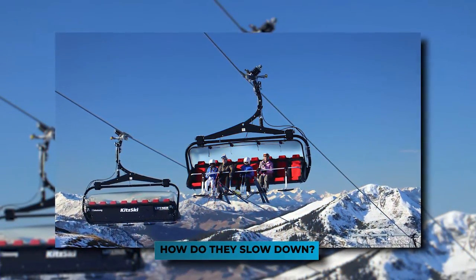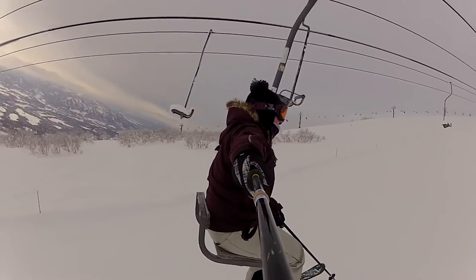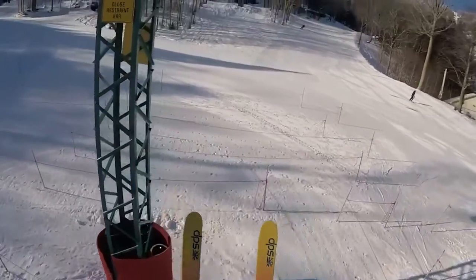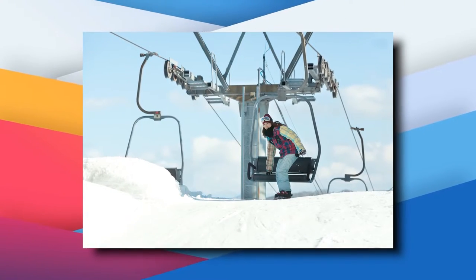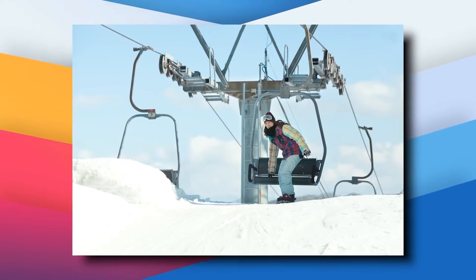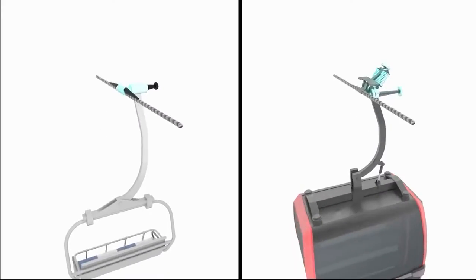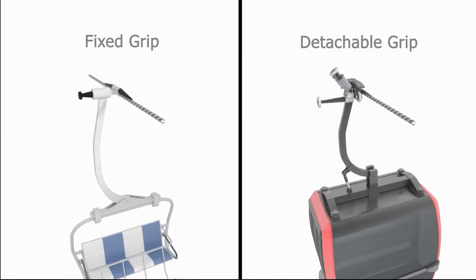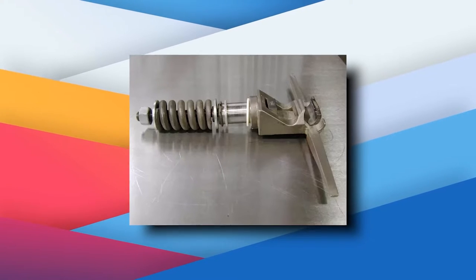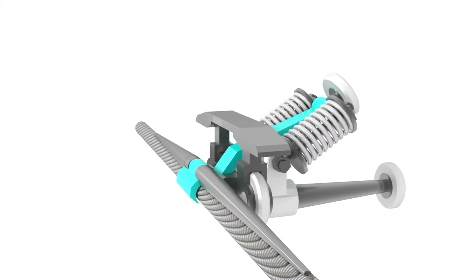How do lifts slow down? Old-fashioned ski lifts have zero slowing capability and can only move at a steady pace. When you reach the bottom, their impact can be painful and unpleasant if you're not experienced and ready to hop off at the right moment. Modern ski lifts, especially the big ones, can change gears and switch from higher to lower speed easily. Once passengers have boarded, they can switch back to the main cable at faster speed, such as with gondolas. Detachable lifts use a unique mechanism where a cable is fastened using a strong spring-loaded cable handle, and the grip detaches at each terminal, allowing passengers to load and unload easily.